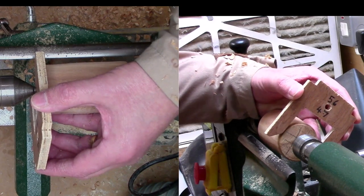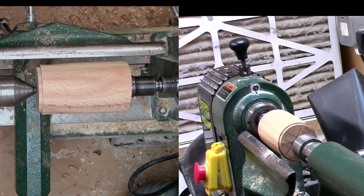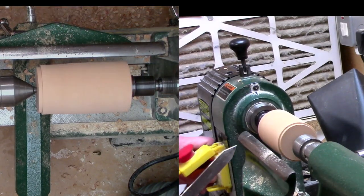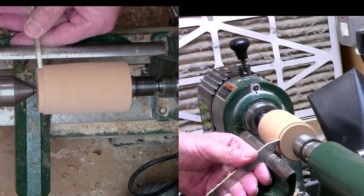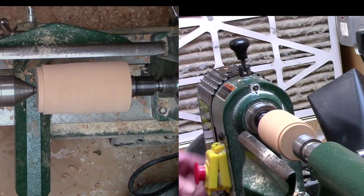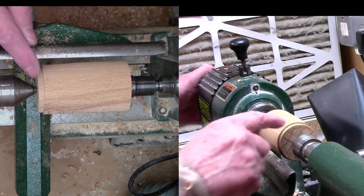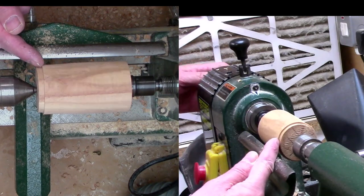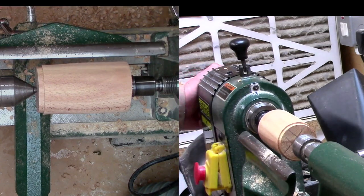So we know the spigot is now the correct size to transfer into a chuck, but I just want to make it slightly wider first so it gets a better chuck grip. I don't want it too wide — it will foul the bottom of the jaws — because we want it to sit on the round part here and this face here. We don't want it to sit on the bottom part, so we'll transfer it into a chuck next.